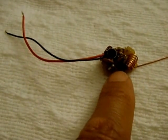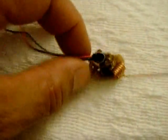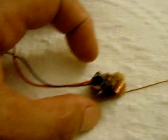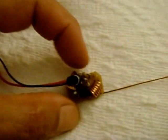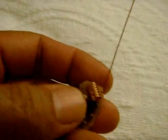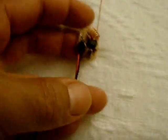The coil is wound on a 7/32-inch form — that's the core you're going to wrap it on. The sound is very, very clear considering there's no transistor for amplifying the mic. You do have to turn the volume way up and then you'll hear it clearly. The range is about 600 feet and it draws 17 milliamps. You could conceal this in just about anything — it's really small.